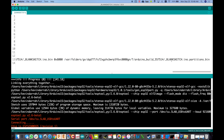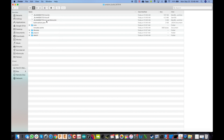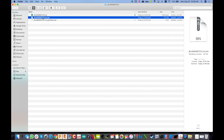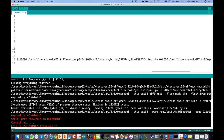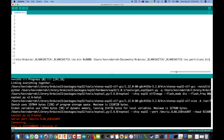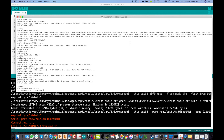To find those files, copy the paths from the verbose output, then on Mac go to Go > Go to Folder and navigate there. You'll see the two bin files. Grab both paths — the first is the main sketch bin, and the second is the partitions bin. Paste them into the command in Terminal and run it. There it goes — I hope this video was helpful. Thanks for watching.